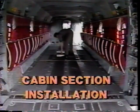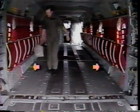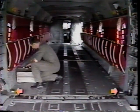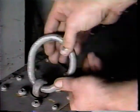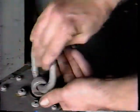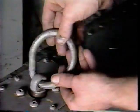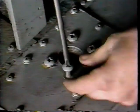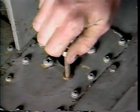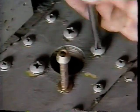To begin cabin section installation procedures at stations 240, 320, 400, and 481.780 on both sides of the aircraft, unscrew and remove the eight 10k rings from the fitting assemblies. For each of the eight fitting assemblies, remove one of the two inboard inside screws holding the assembly, and install an internal wrenching bolt and washer finger tight. Then remove the other three inside screws.